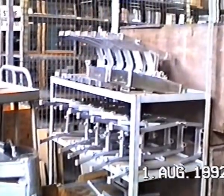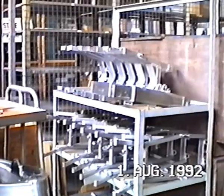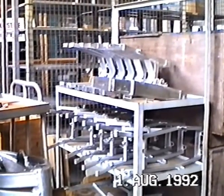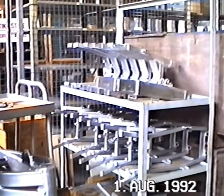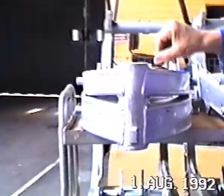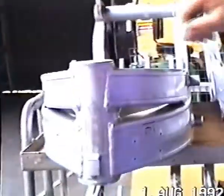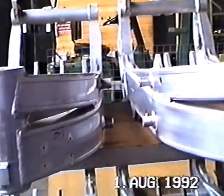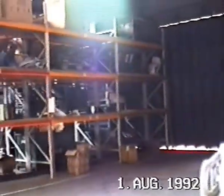For the F1 Sport, they are exactly as that, not painted. Yeah. For the German market, demands that they're painted, and they pay extra for it. Unfortunately, there are problems with painting. This one is reject. The paint hasn't stuck, they haven't primed it. Acid etch, presumably, on... I don't know what to do with it. It's very discouraging when you've built a bike, or partway down the line, building the bike, and the paint comes off. Can you imagine?